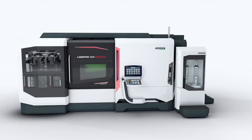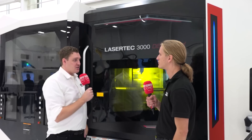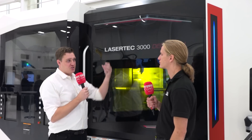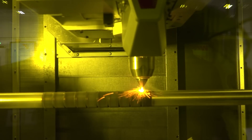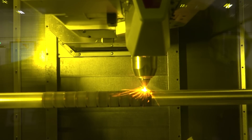This is a pretty unique style of additive machining — it's direct energy deposition. So directed energy deposition means that we've got a laser coming out of our nozzle directing the energy at our part, and the deposition part is that the nozzle also shoots powder out at the surface of the part while we do the weld.